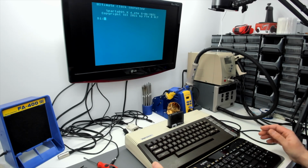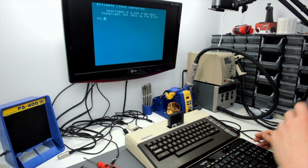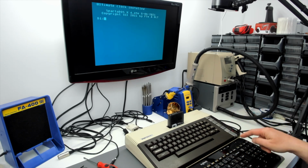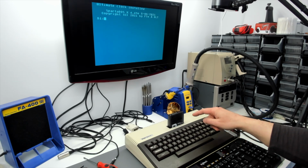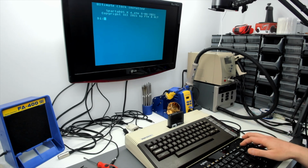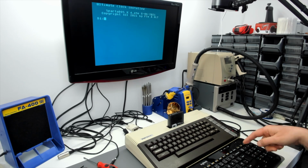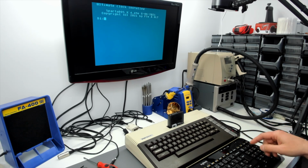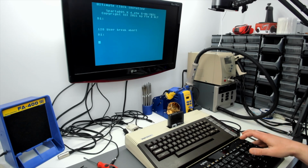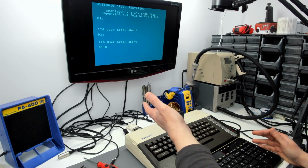Anyway, so let's have a look. What we had before, earlier in the video, was we had no break key, and in fact when you pressed the pause break key on the USB keyboard, we were actually getting zeros and right braces sometimes, which was very strange, and it was generating a key click. So there's obviously something seriously wrong. So now if we press FN pause break on this particular keyboard, because it's one of those keyboards where you've got a function modifier key but it does still have that pause break key on the board, we actually get the break key.